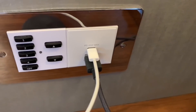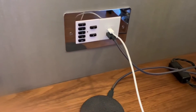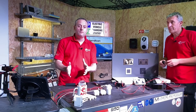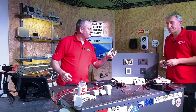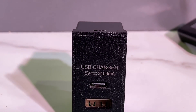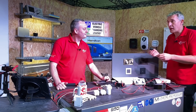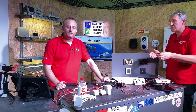You can use the USB-A at the same time - you've still got those legacy devices, so I also plugged in the wireless charging device for an iPhone into the same charge module. That shows what a fantastic advantage it is using Euro modules - you can remove the 10-watt one, replace it with a 45-watt one, keeping the same surround and the light switch mechanism on the other side. They also do a single module version, though it doesn't have quick charge or power delivery. It supports up to 5 volts at 3.1 amps, which is still useful if you want to build a combination plate.